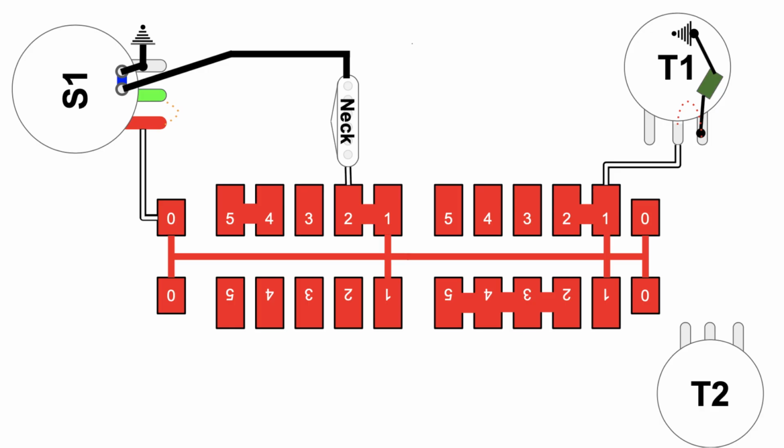So let's stay here, and you can see that in this configuration, again, the S1 button is in the up position, and the Super Switch is in position 1, closest to the neck. You'll notice that when we removed a whole bunch of connections, even the second tone pot is out of circuit. Okay, now what's happening here? Let's start with ground. As I said earlier, here's ground. We follow ground over to the S1 button. This connection is made between these 2 nodes on the back of the S1 button, goes this way to the neck pickup. That makes sense because we're in the 1 position closest to the neck. Down to node 2 here, which is bridged to node 1, which takes us to the backbone.